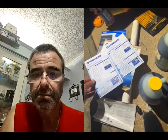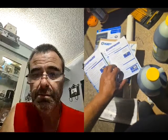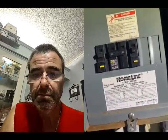No, not at all. I mean, you showed me the sub panel. You had a 2 pole 20 amp in there, right? Yeah. And what were the breakers on either side of that? They were, I believe, C20 on the single one. Okay, but that's only another 20 on the other side. But they're single, so they're only going to give you 120. Yeah, I don't know what they're used for, to tell you the truth. It might be for the lights of the pool, I think.